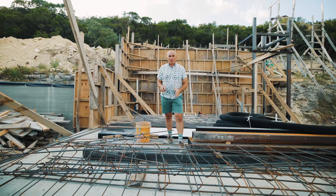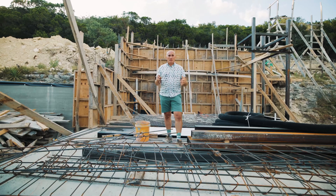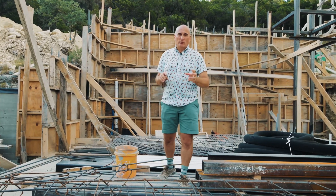The design process always starts with a comprehensive topographic survey. Once you have the topographic survey and architectural design, you need to move on to structural engineering — the structural engineer must create the correct design. For this, you need to get a soil report or geo report. You order this separately and pay for it, but this money will pay off.